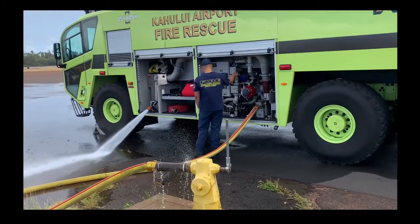Right now our driver is doing our morning check. He's basically simulating as if he's on scene because he has no firefighters. He's connected his nozzle directly to the discharge, he's running a supply line from the hydrant into the truck, and he's just running it as if he's on scene, making sure everything is running correctly for the shift.